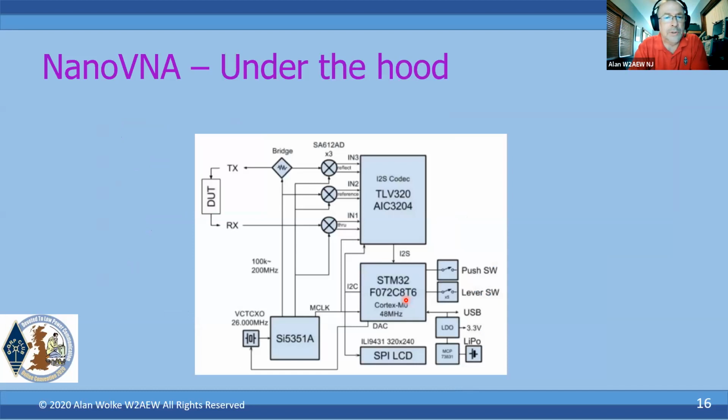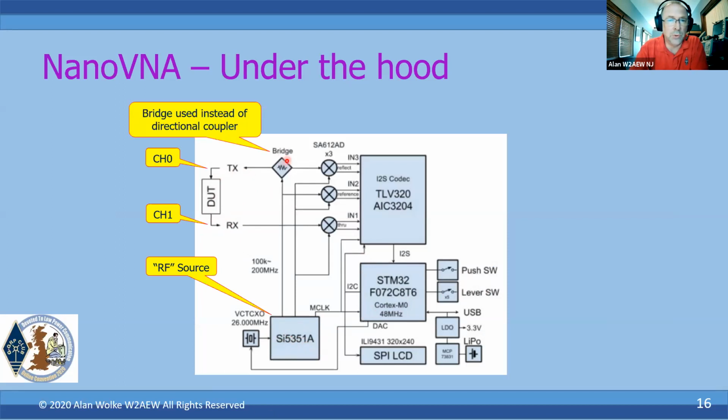So under the hood, what's in there? It's actually a pretty simple device. We've got here our channel 0 and channel 1, our transmit and receive ports, so essentially port 1 and port 2. This is our RF source. How many times over the past 2 days did we hear people talk about the SI5351, the microcontroller-controlled synthesizer? That's what's used inside the NanoVNA. The nice thing is it has multiple outputs. We can supply one output to a bridge, which is used instead of a directional coupler, for the signal that's going out to channel 0.